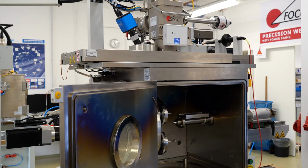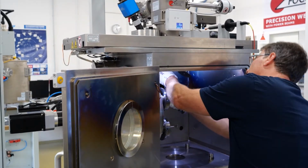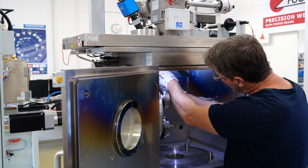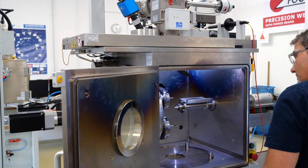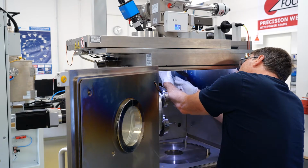The electron beam generator, as you see it on top, has a tube inside protecting the beam, and this holds the shutter, and this holds the sacrificial glass, and it also protects the entire beam from magnetic interaction with everything which is surrounding, right? Basically, the two screws are just opened by Thomas.